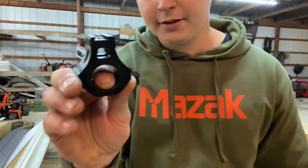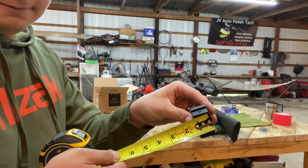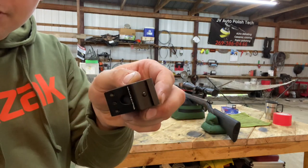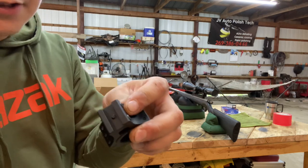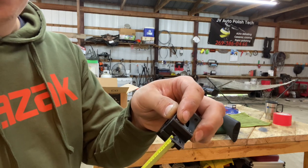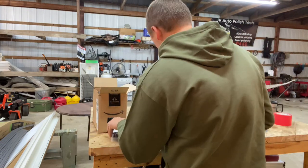Look how much meat you get on this surface — I mean, we get an inch right there with my tape measure. That's a lot of surface for a dovetail. And they have a set screw. Now that set screw is not pointed, but it doesn't necessarily have to be because it's probably aluminum — it's just going to add friction to the top of the rail and help pull up against the dovetail slot to make these really tight. I bet those aren't going to move really at all.